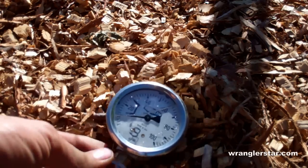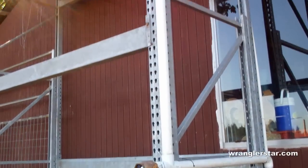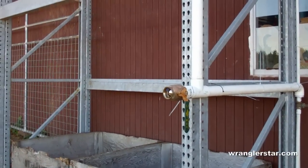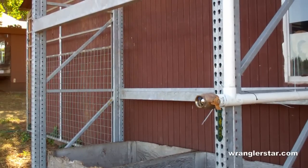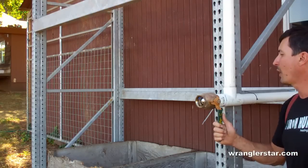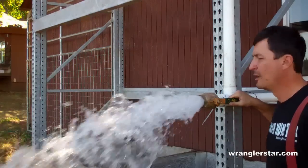Here's the fun part I've been waiting for. Off the water tower I've put in a nice big two-inch supply to a ball valve for a fire connection — I can connect a fire hose to it. Primarily, I designed it so I can back up my water tank brush rig, my fast-attack wildland fire rig, and fill it up twice. I've got a 500-gallon tank up here and can fill the 250-gallon tank on my truck quickly. The idea is: if I run out of water, throw my quick-attach valve on here, pull it, and there's plenty of water.